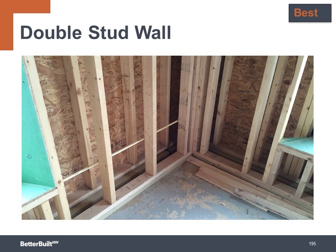As you can see, the rough-in work for the electricians and plumbers can be substantially less labor-intensive since wiring and supply pipes can run through the gap between the walls, eliminating the need for much of the drilling that's typically involved. For the insulator, installing blown-in product, it will involve a change of workflow.